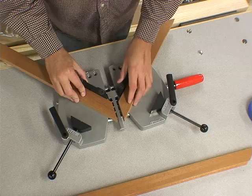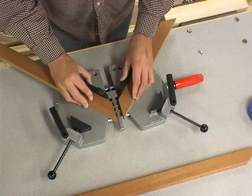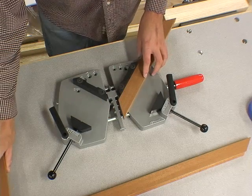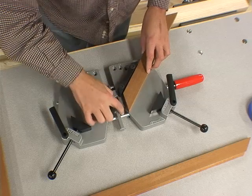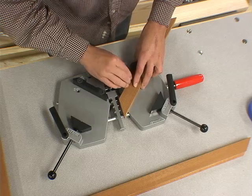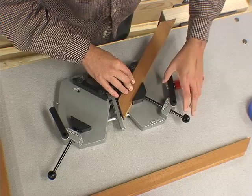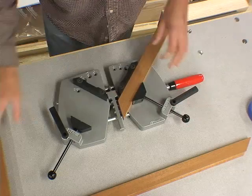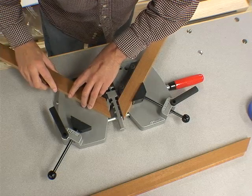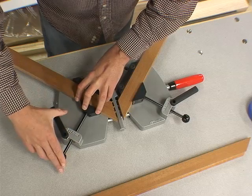And you just push it up against that black piece there, and then slide it against that centering jig. That just helps align them. And here I'm just demonstrating. I only need to do one at a time, actually. Here we go. So I got those two surfaces I'm pushing against, and as I push it against those two surfaces, I can just push this clamp jig here and then tighten it down. And now it's clamped that first board into place, registered up against that centered piece of the jig. And now clamp the second board into place.